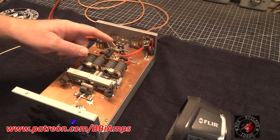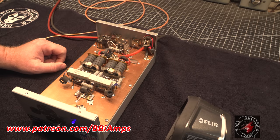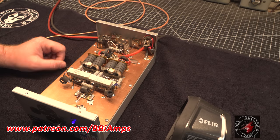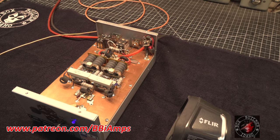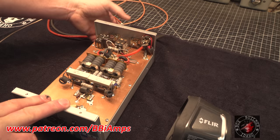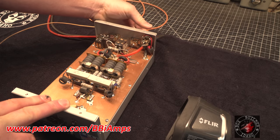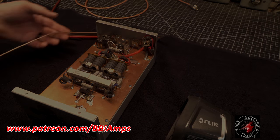We'll find out. My balancing resistor is getting hotter and, well, you can see it, it's discolored. So it's been warm. But we're gonna rip this apart. Let me grab the other amp, which is a 16 pill, and we're gonna take a quick look at it. But for right now, we know that we've got two dead transistors in this thing. So let's hurriedly check this out and move on to the repair portion, I think.